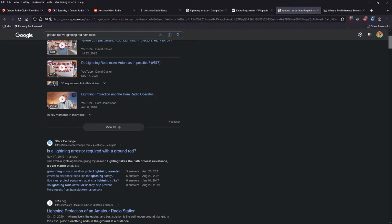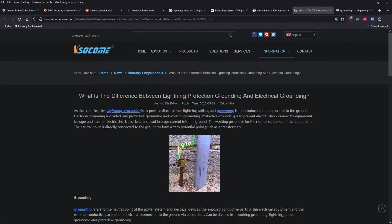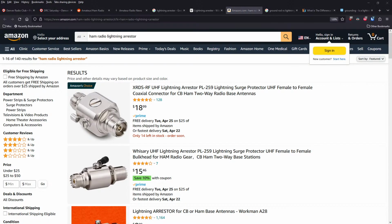I think there's a difference in electrical stuff between neutral and ground, but for what you're doing, doesn't an arrestor usually provide an air gap that the charge can jump to, to shunt it off of your equipment? There's different types of things that they use for that. Sometimes glass tubes, others with what's called an MOV, but that's more for electrical stuff. So as long as it's a conductor and it's in the ground, a big thick copper rod is going to do it.